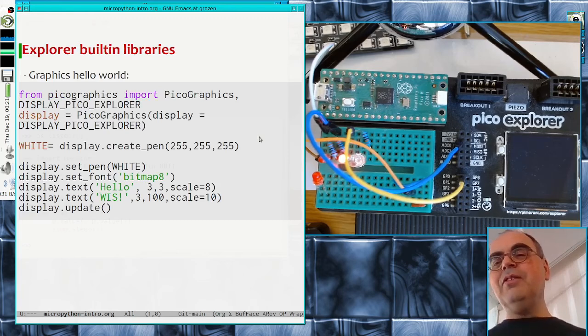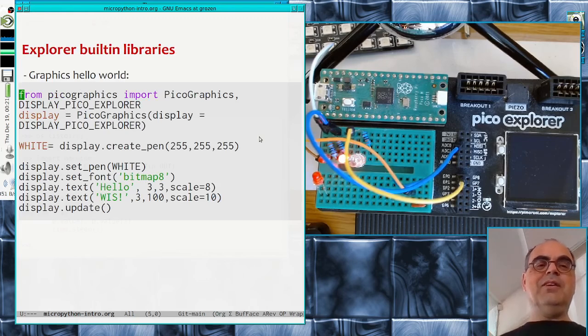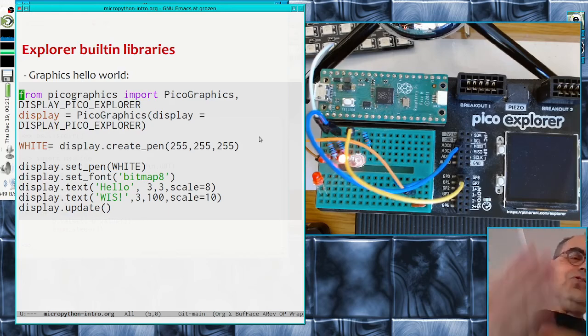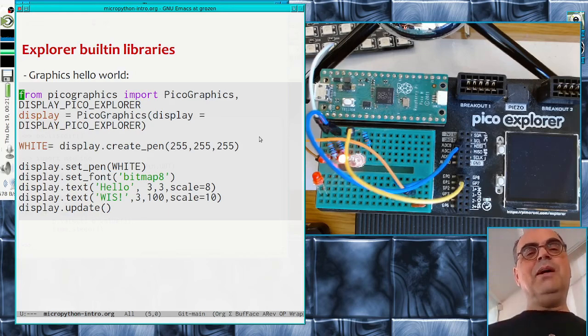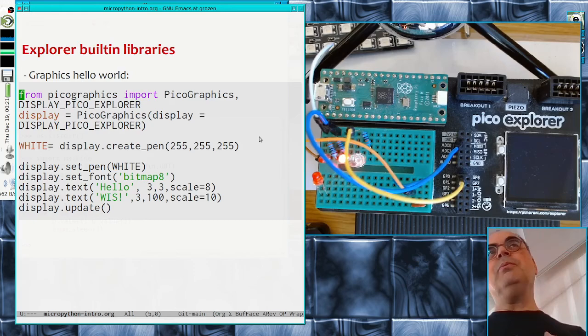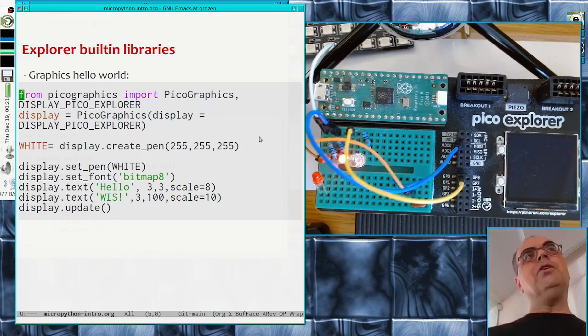Now, what's nice about these boards is that they come with extras. They have extended MicroPython. You can extend MicroPython yourself also if you want. If you have some time-critical code that you want to write, you can actually create your own version of MicroPython. So you can do most of your program in Python and then just have the time-critical routines written in C++.